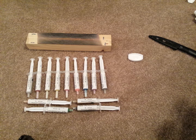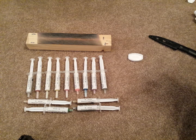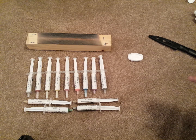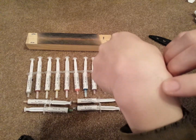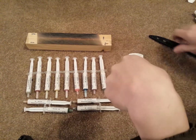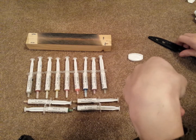For those steels, right now I'm working with a mix of between 0.5 and 1.5 microns. And really, for those types of steels, that seems to give you the best edge that is absolutely screaming sharp — it cuts better, and it cuts better longer. And it looks like I'm starting to bleed a little bit. So as you can see, I was just trying to shave myself, and the edge bit in enough to cut me. So they are quite sharp.